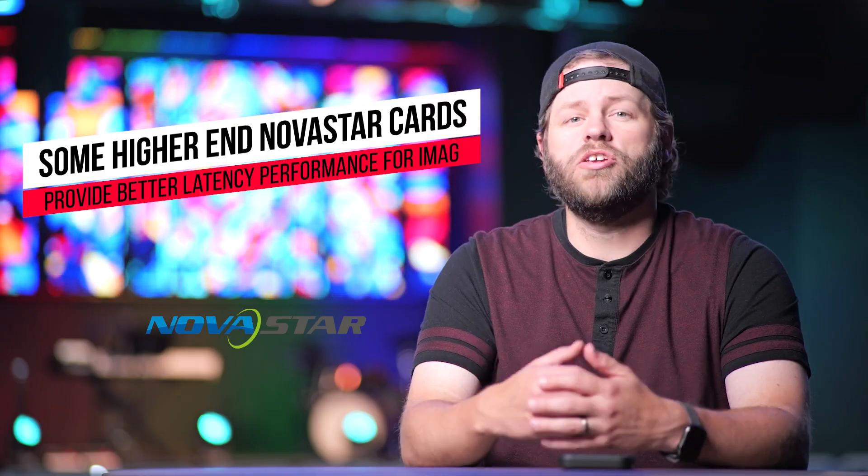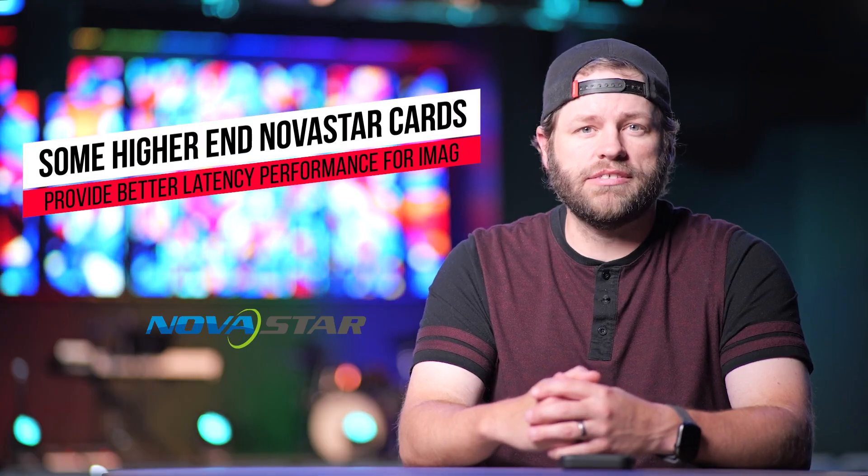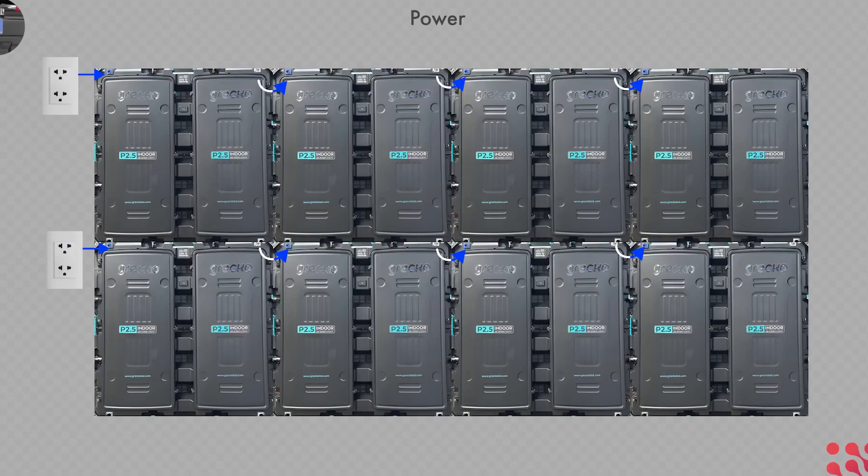Just don't go below 3840 on refresh rate. Receiving cards are another spec you'll see on the sheets — if they have a NovaStar card you're probably going to be good, because it's going to talk to the industry standard NovaStar processors that most churches are going to end up using with their LED walls. One more important spec to consider is the aspect ratio of your LED wall. Most LED wall panels are not a true 16x9 landscape ratio HD format panel, so you have to combine them into a grid to achieve something similar to that.